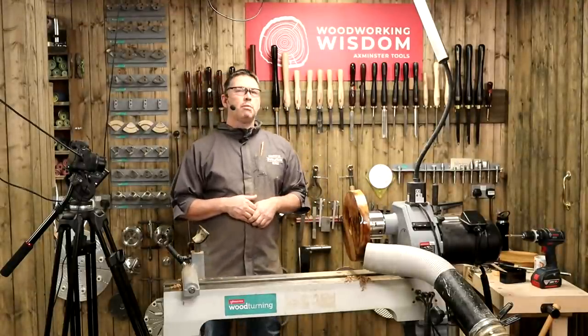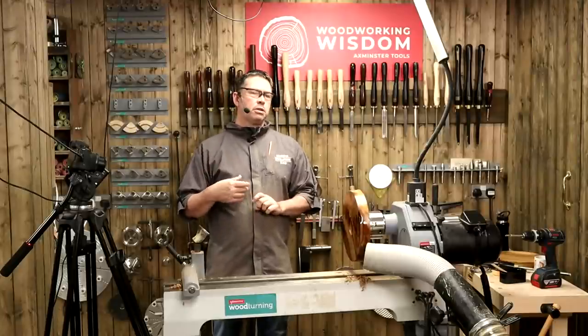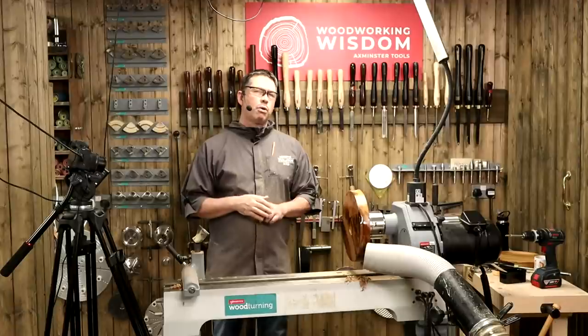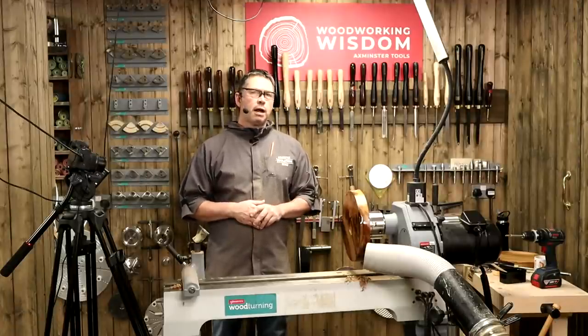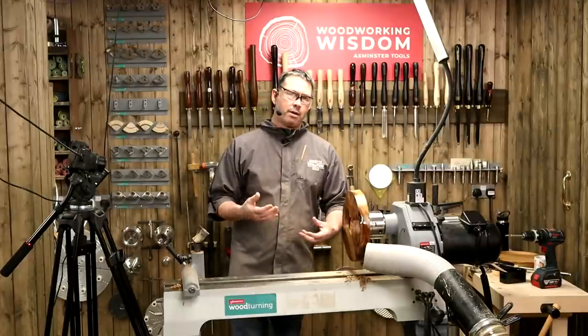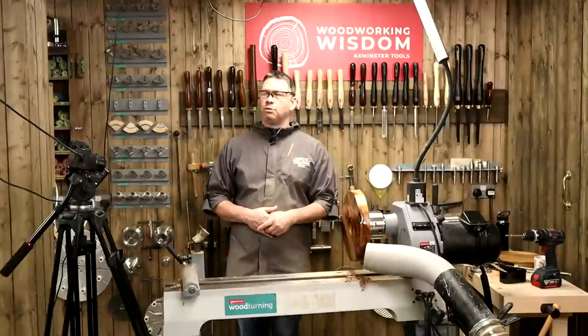And I just feel that you get a better finish before sanding and things like that. But no, I don't think you're going to be in a worse place. But you'll have some experience, like I say, you have with the skew. But your bowl gouges, if you can concentrate on getting a bowl gouge working nicely, maybe then leading on to a spindle gouge, that sort of thing, I don't think you'll have a problem. Yep. The big difference, of course, between carbide and traditional tools is the bevel. You've got bevel rubbing on traditional tools.